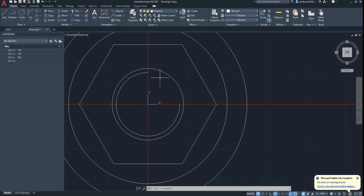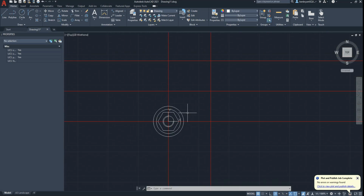Now there is a specific size for an M18 times 2. You can go on to engineering charts and tapping charts, and they'll tell you the minimum and maximum diameter of the pitch. Every 2 millimeters there's a pitch rotation, and it'd be about 2.25 mil deep. I'm not going to go into too much because these thread references are done from either a tap, a die, or a machining characteristic, or you're naturally going to buy the nut and bolt with the M18 times 2 designation, and it will be pre-cut for you. So I'm not going to worry too much about that at this stage.